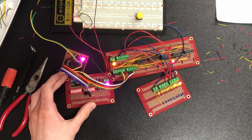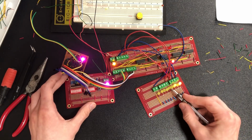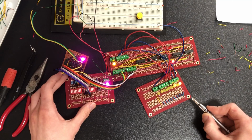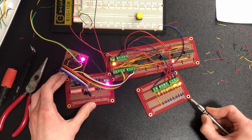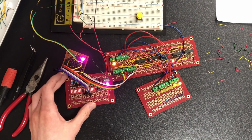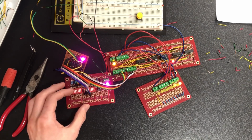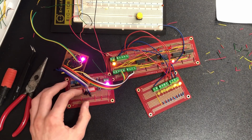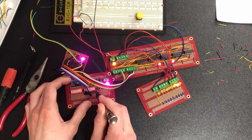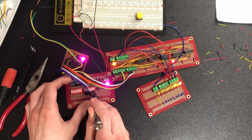So you can essentially add anything up to 16. And because it has a carry out, you can really get 5 bits. So you could really get anything up to 31, but there will be 2 of these, so you'll be able to go up to 511. Anyway, right now I'm doing 2 plus 3. Well, let's switch that around, so we're doing 3 plus 2. And of course I get the same thing.